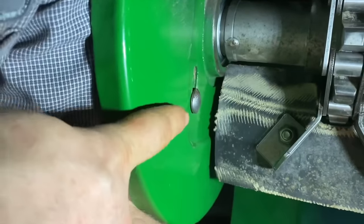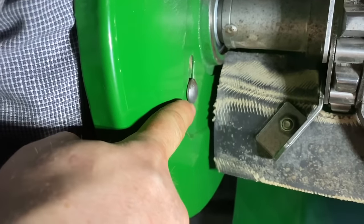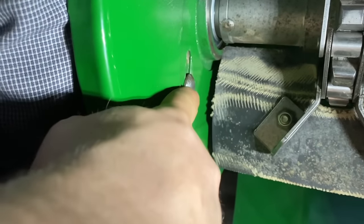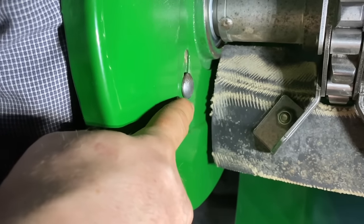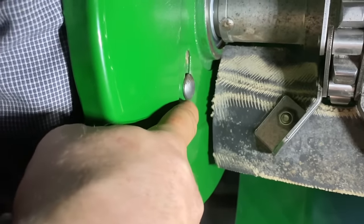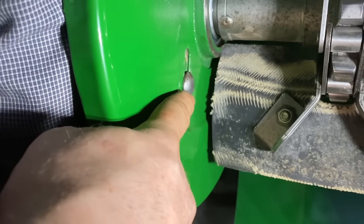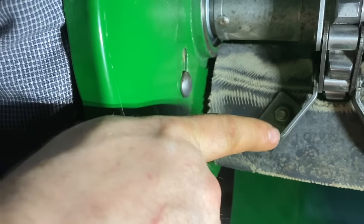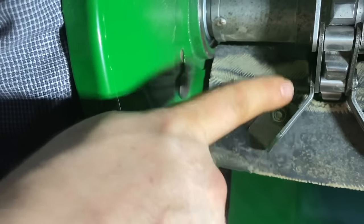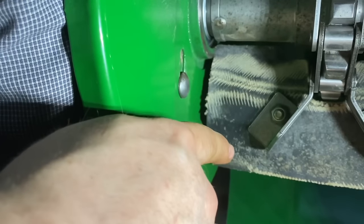So once you get it adjusted, you want to take a look at how far down your carriage bolts are in the slot. And you can see we've probably got maybe 1/4 to 3/8 of an inch left of travel, and we want it higher to start the season. So we'll go ahead and loosen up these bolts again and raise this up just a little bit,